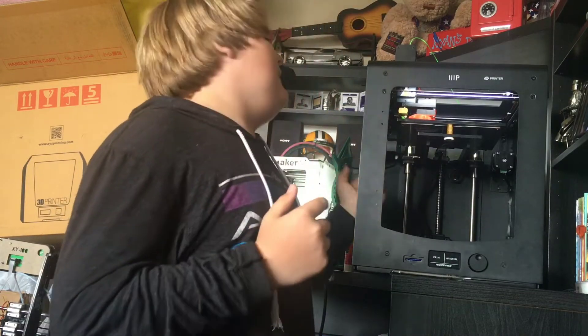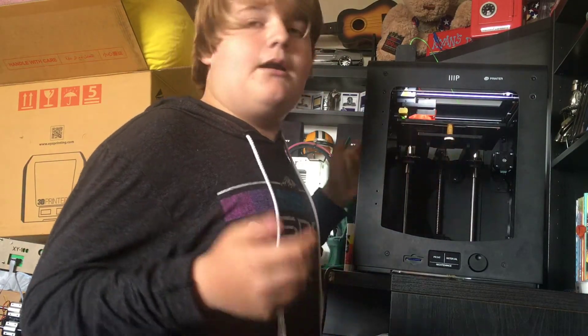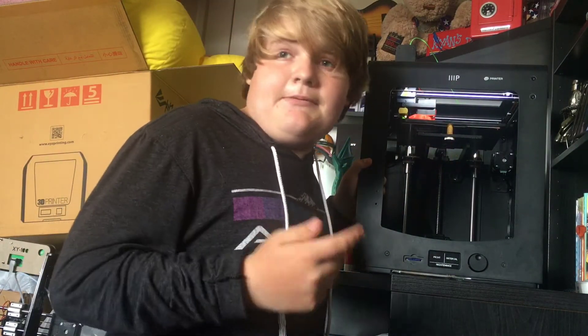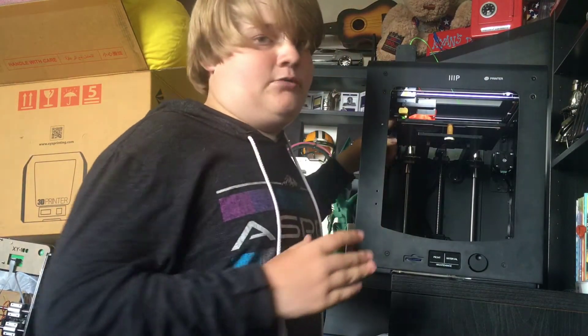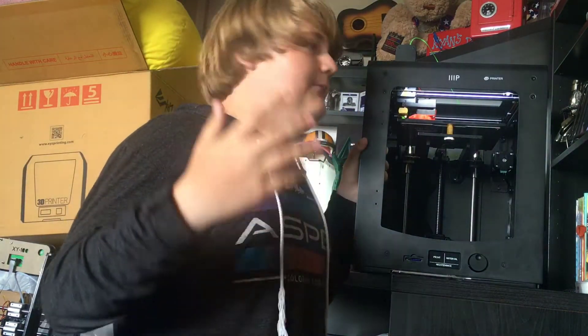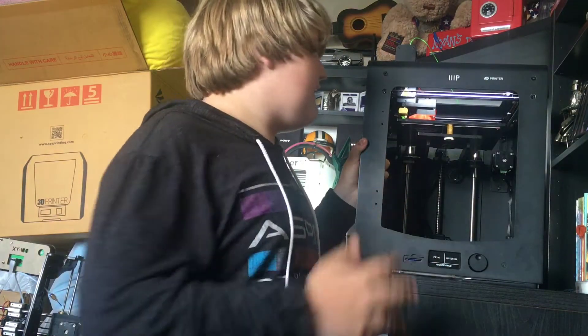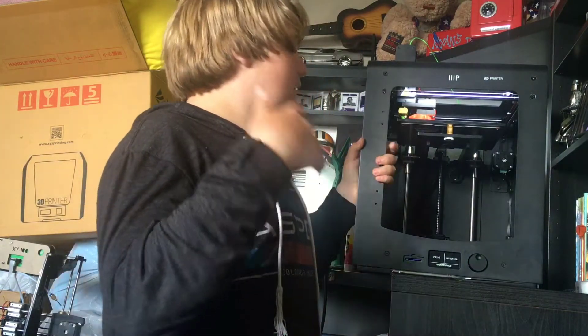In American terms that's about 8 by 8 by about 6.87 inches, but it can go up to 8 inches depending on how your limit switch is mounted and how tight you have the screws. Either way it's a pretty big build volume. The issue though is whenever I go over 180 millimeters on the build plate it says 'error — print is out of the build volume,' which is annoying, but besides that the build volume is fantastic.